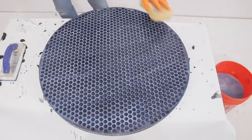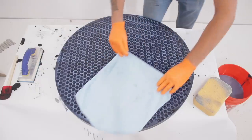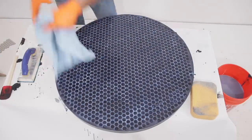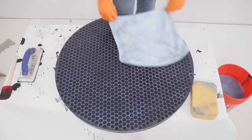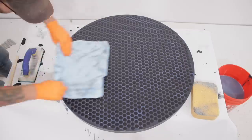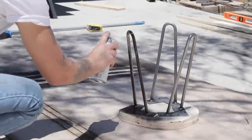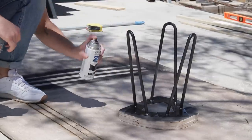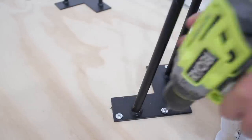If you're working with traditional grout, you would let the haze dry on top of the tiles and it just wipes away. But with this Fusion Pro grout, you drag a clean microfiber cloth across the surface while the haze is still wet — if it dries on the surface it's apparently really hard to remove. This product is not cheap, but it applies quicker than traditional grout and you don't have to go through the process of sealing it after the grout is cured. I use these 16 inch two rod hairpin legs all the time on coffee table projects — they're perfect for projects like this and I'll leave a link in the description. Once the legs were attached, this project was done.